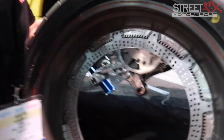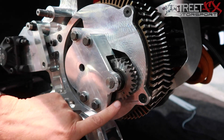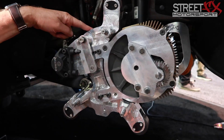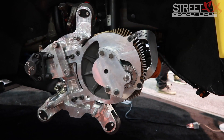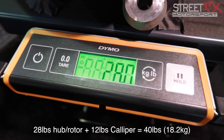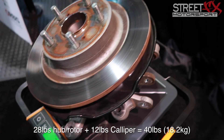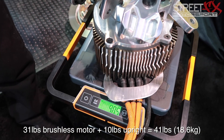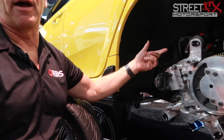There's a 50-horsepower direct drive motor on each wheel and a two-speed gearbox, with no penalty in unsprung weight. I looked at this motor and thought there was no way it would weigh less than the factory setup — I was wrong. The braking mass, the hub, all of that weight removed allowed us to mount a 31-pound brushless 50-horsepower motor with no unsprung weight penalty. Effectively we've taken a front-wheel drive car and made it all-wheel drive without any extra weight — no driveline, no axles, and you get torque vectoring for free.